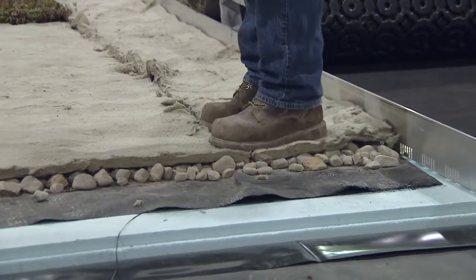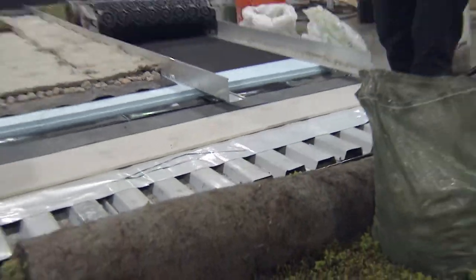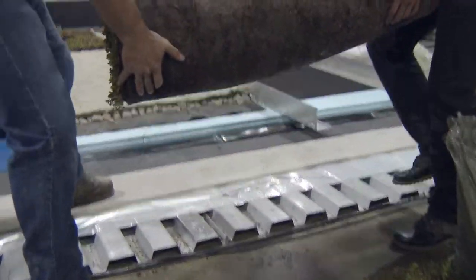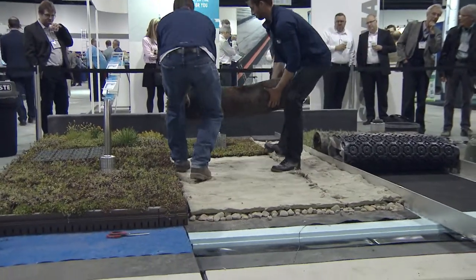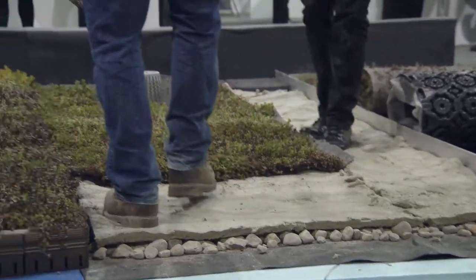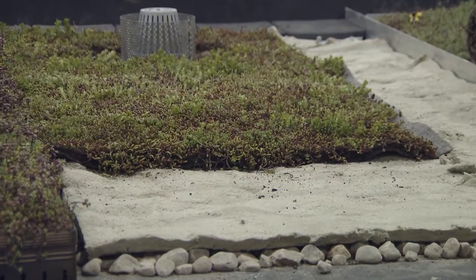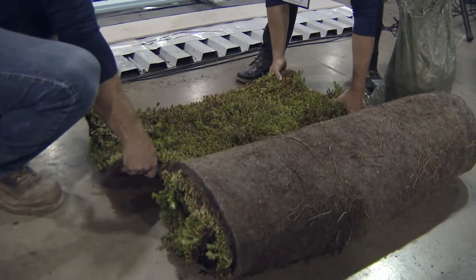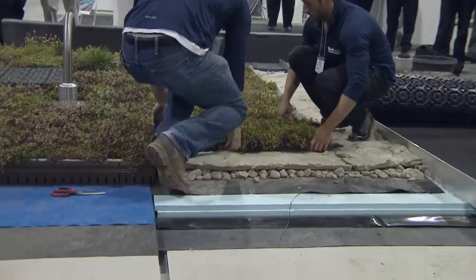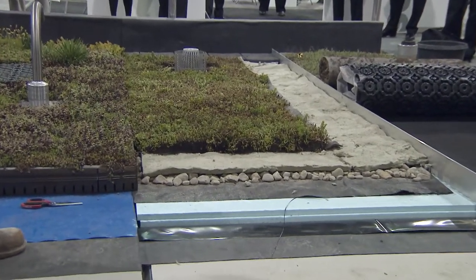After the mineral wool component, we have the vegetation mats. These come in rolls or sheets and can be custom cut — typically two meters long, but can also be one meter or longer. The vegetation mat is a thin profile, about an inch in thickness. It simply rolls out on top of the mineral wool, and the next piece is abutted very tightly to the first — you want nice tight seams, very similar to sod. Since there is no loose growing medium, the mats can abut directly to the edge or around a drain.